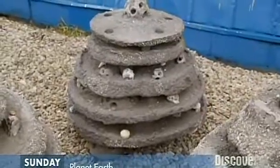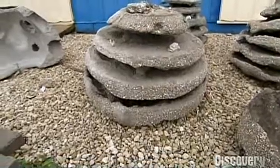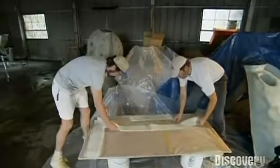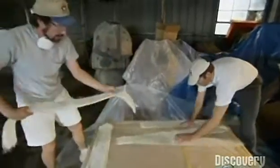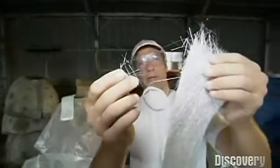We're going to start out with making the layer cake, which is a new reef ball design that we build with layers for lobsters and crabs and crustaceans, which like it the best. We're going to have a ball and eat some cake. Exactly. And before we do that, you're going to make a shell. These here are triple layers of 1.5 ounces, right? That will be laying around the edge. This is basically fiberglass, and it's the resin that's going to hold it all together? Yep.